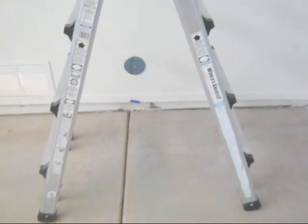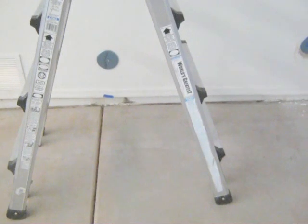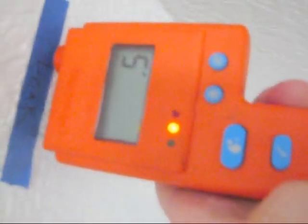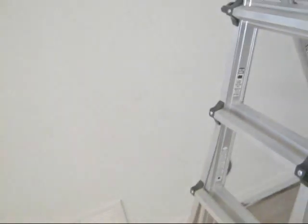This particular house I inspected last week and found a few leaks. The seller sent a contractor over who said there are no leaks — he couldn't find anything. So I've come back this week to verify it. I ran the water upstairs and I've been here for a little over an hour. Twenty minutes ago I wasn't getting any moisture readings, but now it's starting to show wet at 0.5% — right at the borderline — because it's taking time for the water to soak through the drywall. If you come in for 10 minutes, run the sink, flush the toilet, you're not going to find it. You've got to run the water and wait for it to soak through.